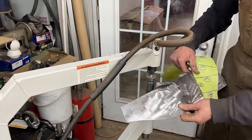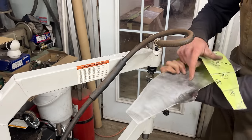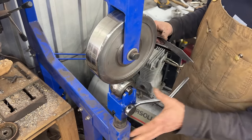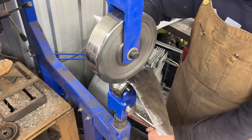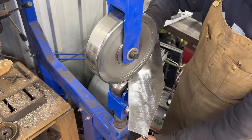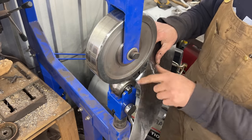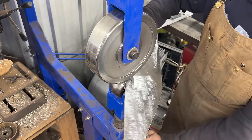Okay, let's see if we can do a little bit more on the English wheel as we're smoothening it, because now there's all hammer marks and all that. So here again we have the highest crown that I have, and I'm gonna continue stretching it while we are also smoothening it. See, this is the reason why I left more material here, so I don't fall off the edge all the time, and still I'm falling off the edge all the time, so it's hard.